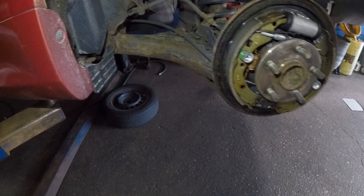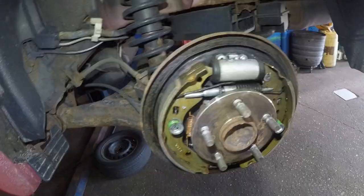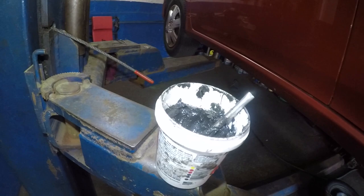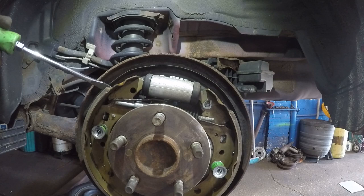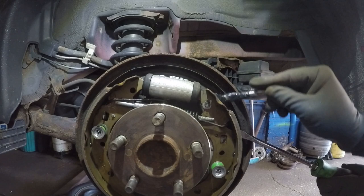What we're going to do is move on to the next point, which is going to be greasing the little contact spots. You want to grease at several points. You can remove the shoe retainers to do it, the shoe will come forward, but in our case all you need to do is just lift it up a little bit and use a brush. Get your grease brush ready, lift up and just smudge a little grease right in back of it — that's how simple it is. If you remove these retainers it'll be even easier to get to the rest of them.